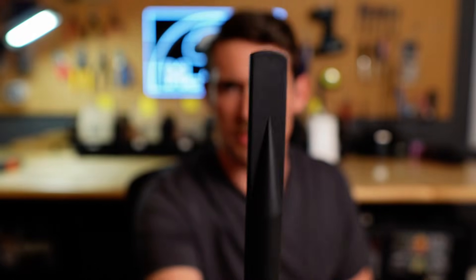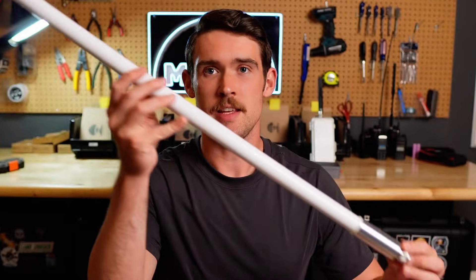Maybe you don't need a super high-gain antenna if you're specifically trying to service your local area. But if you're really trying to get a long-haul repeater up to connect one area to another, that's a different use case and it will impact your antenna decision. Whether you pick a really high-gain antenna or a low-gain all-purpose antenna intended to service your local area, it's up to you to make that decision. If you're not liking the results, just try a lower gain antenna. Low gain doesn't necessarily mean low quality — here's an antenna I've used on some of my mobile deployable repeaters that is really high quality but lower gain.